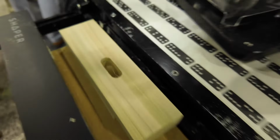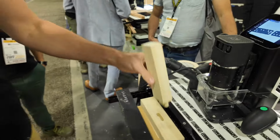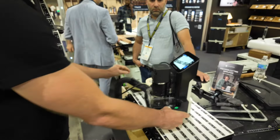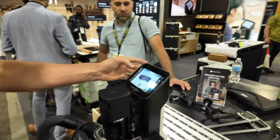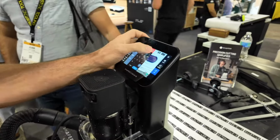And let's take a look at how that goes together. This is a tight fit. We cut this to a 0 offset and this to a 0 offset, which is perfect. This is how it should be. And now we're just going to come back and change this offset to a small negative number. Let's say 8 thousandths of an inch.